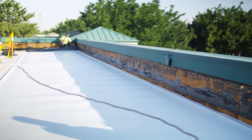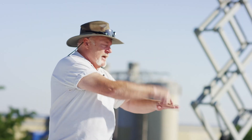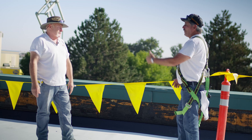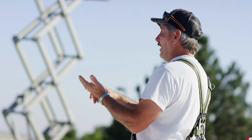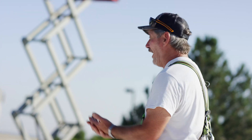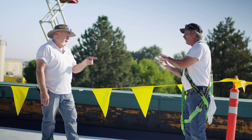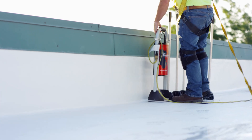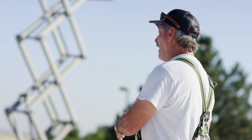Dave, we have this wall flashing here. There are a couple of ways to do this. One way is to tie your sheet into the wall, do mechanical attachment with a seam plate, and then do a separate flashing down the floor. We've been doing that for years. Depending on how long it is, you might do it in 10 or 20-foot sections, and every section you have to stop and start, change angles, do a vertical, do it by hand. We preach about eliminating hand welding as much as you can. We've got a 100-foot wall flashing here done in one shot. For our base attachment, we use induction welding plates every 12 inches on center. You can take this up in one shot — you're eliminating a lot of labor and a lot of steps.